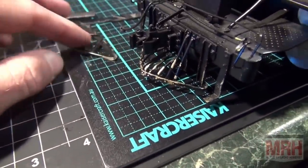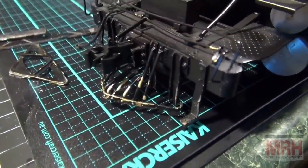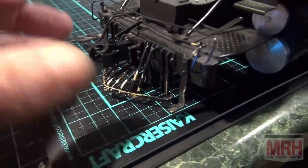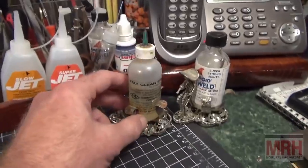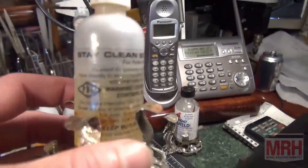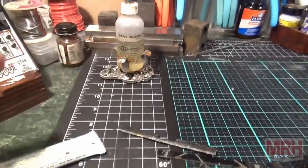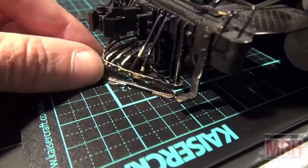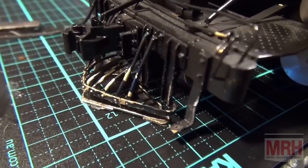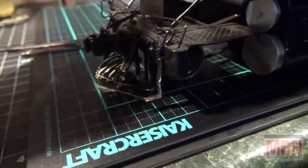So normally what I would do is I would sandblast this whole locomotive, but today I'm going to take some lacquer thinner and a wire brush, and I'm going to clean up the parts the best that I can. And then we're going to put some liquid solder on there and some acid core flux from PBL. I really like this acid core flux. Now this stuff will have to be washed off so the solder joint doesn't continue to eat itself away because it's acid core. But after this is all finished and it's all cleaned up, and all the solder joints are in place, it should be virtually as good as new.